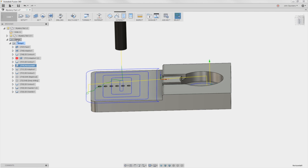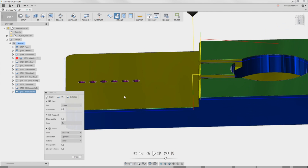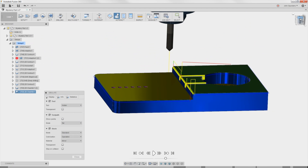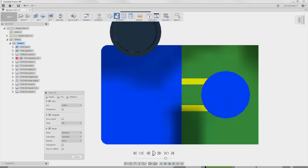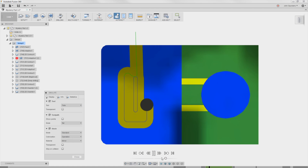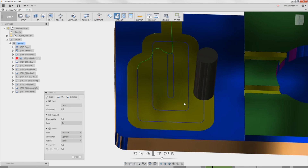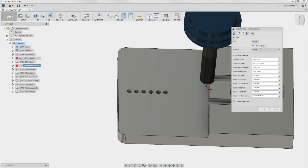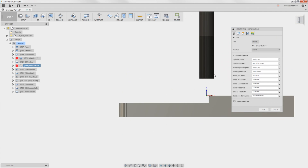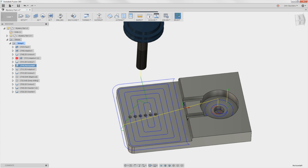On the horizontal - did that show up in simulation? Let's go back and hit play, flute only. See, it would be right here. I don't know why... clearly it is leaving them. Got the right tool - half inch bull - oh, is that why? That is why: because this tool has a slight bull nose radius. So let's reduce the step over to 0.3 - that should give me tighter passes which should get rid of those scallops.